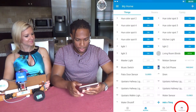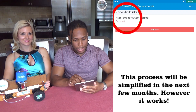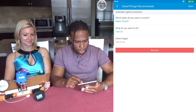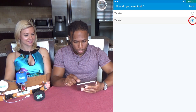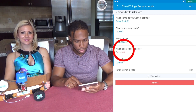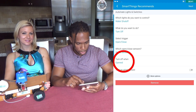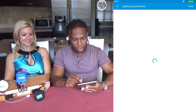Open the SmartThings app and click on Marketplace, go to SmartThings Recommends, open Smart Lights, and tap to set which devices you want to control. Scroll down to Water Shut Off and check that box. Under 'What do you want to do,' select Turn Off. Back on the main screen, select your trigger — use the Open and Close trigger — then choose the Water Sensor, check that box, set it to 'Turn off when open,' and click Done.